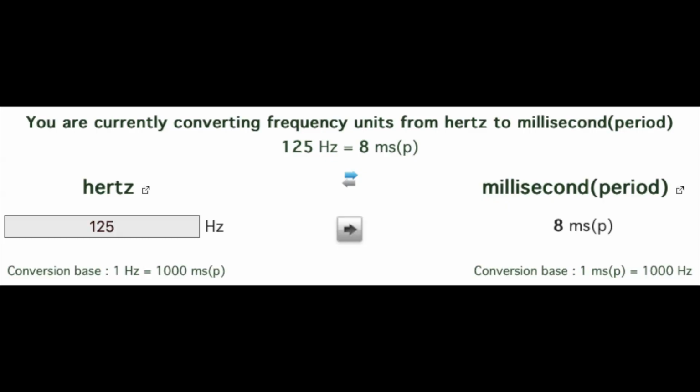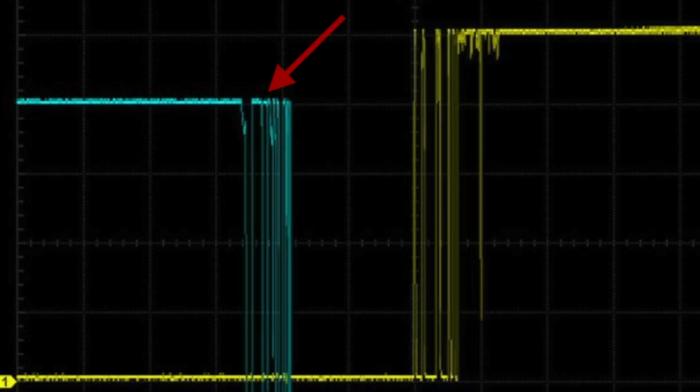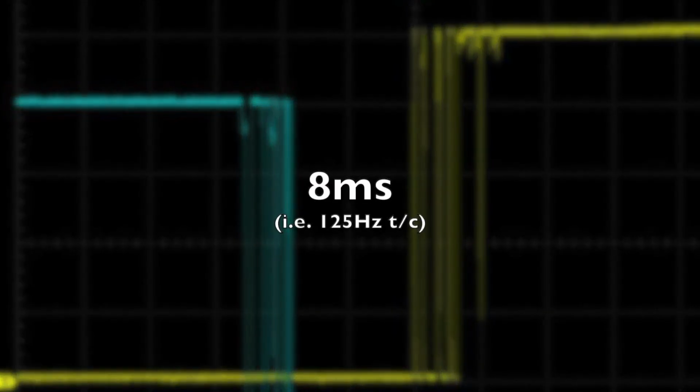Because whether the switch is bouncing or clicking or jumping through hoops or whatever the heck it's doing, your computer doesn't matter because it's not asking for a click. So any of this schmutz that happens between that period is not going to register anyway because your computer just isn't asking for it. So that just means that you get virtual debouncing of about 8 milliseconds because you're just not getting a signal. Now, I know it's not exactly 8 milliseconds because you could be clicking somewhere in between those window times, but maximum 8 milliseconds.